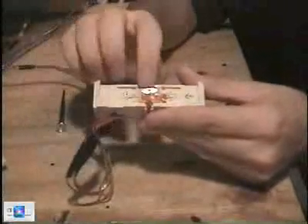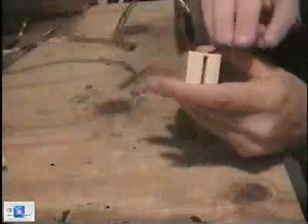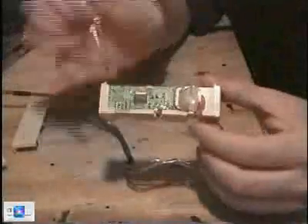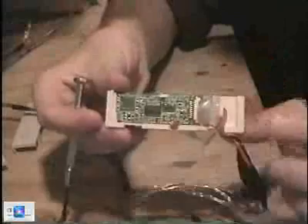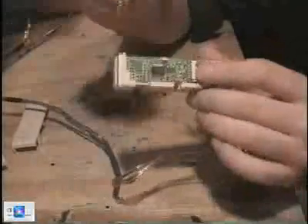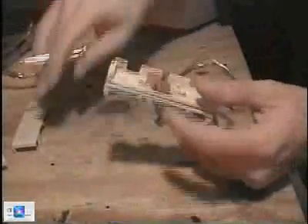This is the side that has the reader head. Again, there's nothing special about this — it's aligned. These little wires actually go over here to this other side. This other side is where the F2F decoder is. You can see where I put some glue in so that the wires wouldn't pull out. The key is how do we get this thing aligned so it can read other stripes.